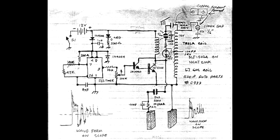One other point that I might bring up, the most expensive piece in this whole circuit is that General Motors high energy coil, out of a distributor cap from out of the car. It's a square coil, and if you notice that it's making sounds when you turn this circuit on, it's because the coil is loose in its metal laminations, and all you have to do is just glue it and it'll stop ringing. But basically that's the circuit, and so I'll leave that there for a few more minutes.